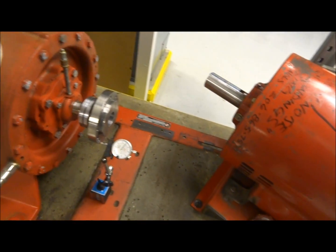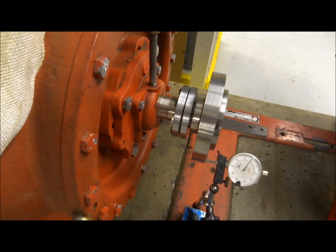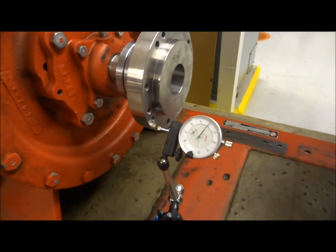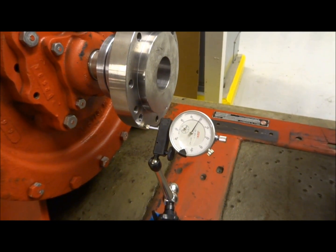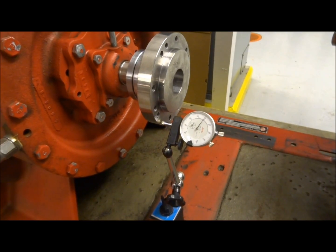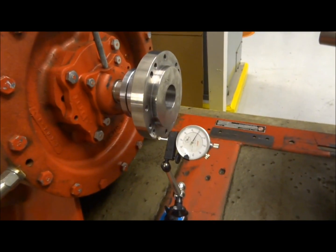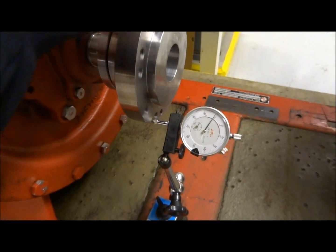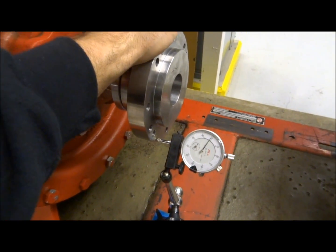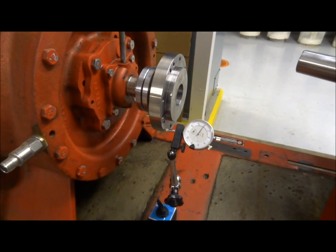The load side hub has been installed. The B-lock fasteners have all been sequentially torqued in four passes to 8.7 foot-pounds. Now I've installed the dial indicator here and I'm going to check the runout on the face of this hub. The installation manual calls for checking the runout on the face of the conductor when the coupling is all assembled, but I typically do this just to find out where I'm at. I'm looking for no more than a couple thousandths — the book says no more than five thousandths on the face of the conductor. This looks good, we're less than a thousandth here.